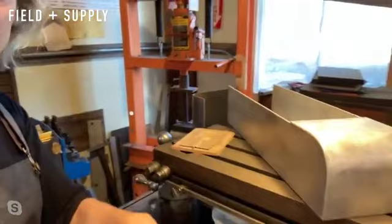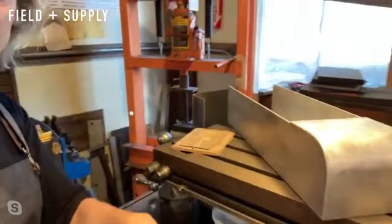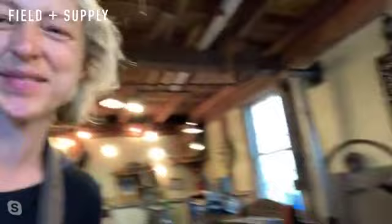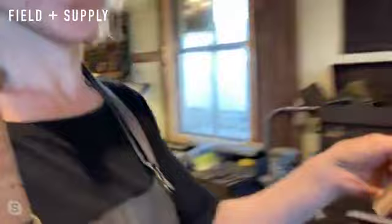This is an aluminum piece for a museum to hold all their brochures — to get this curved piece, I can form it in there. On some of my work, the pressed brass work which is new, these pieces get their shape by pressing brass sheets into a form. The brass sheet gets pressed and takes on that form, then it gets cut out and wrapped and shaped around the charred maple handles.